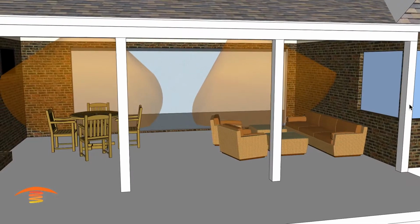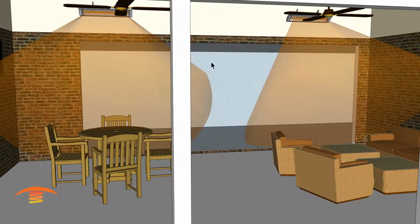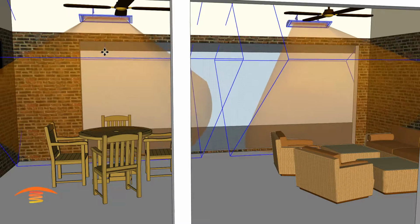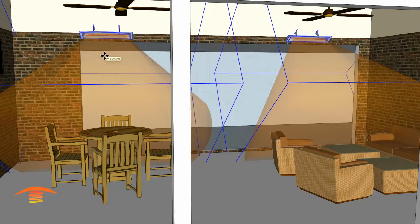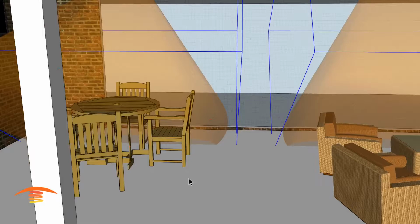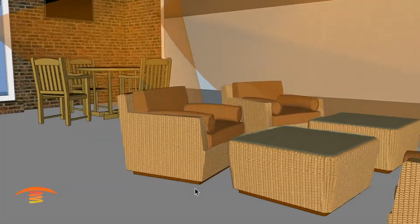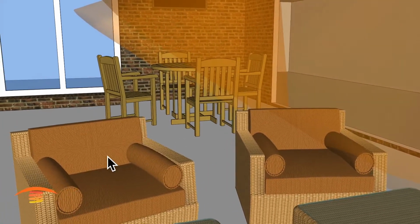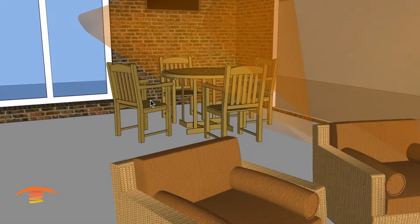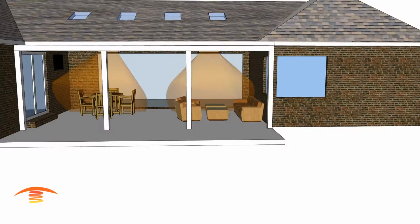All right, so that's one option. And again, you could move these down and still meet your clearances. So if you took this heater and this heater and just did a straight-on move down, let's say, you know, 18 inches, you can see that your heaters are a little closer, but that ray still isn't penetrating as nicely over here and over here as you'd want. But that's just another option. All right, let me go ahead and turn that one off.